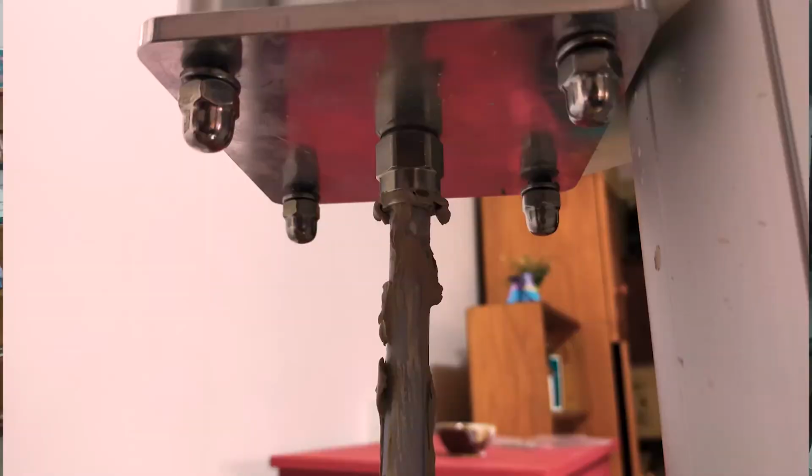Once the air problem was solved, I had clay that would come out of the piping and then start escaping out of the piping. It wouldn't actually stay in the piping. It would come out and just go everywhere. So number one, the clay was maybe a little too wet. It wasn't the air pressure because they have an air pressure valve at the top so air escapes, so that the pressure doesn't build up too much. Obviously my fear of the tank exploding won't happen because there are safety measures, but hey.